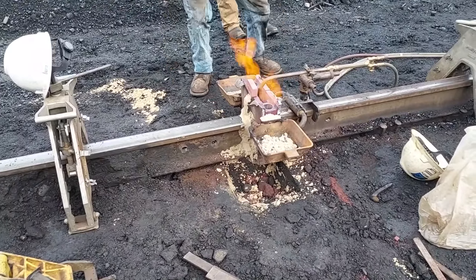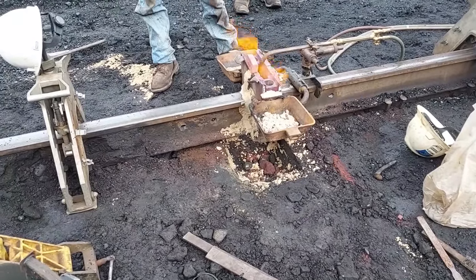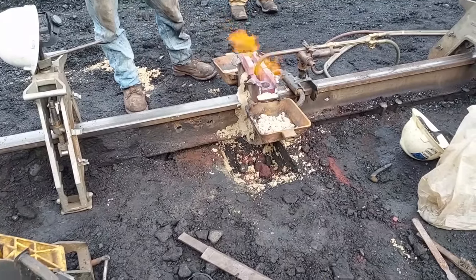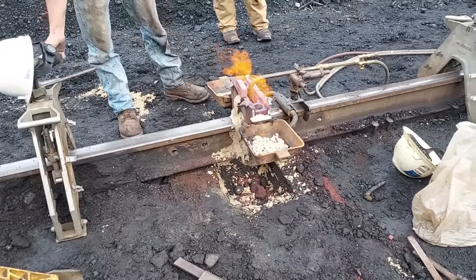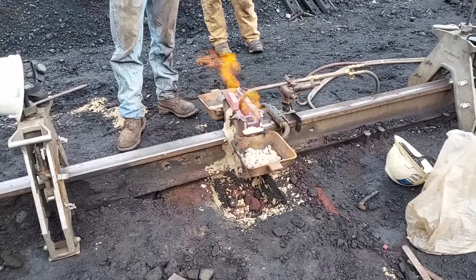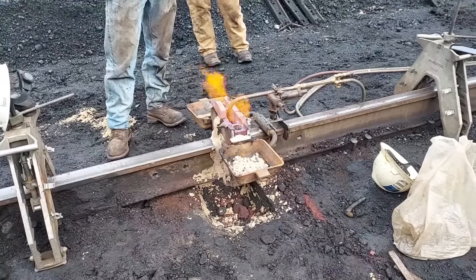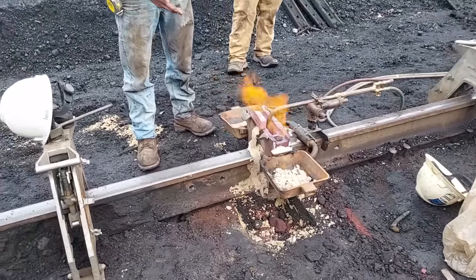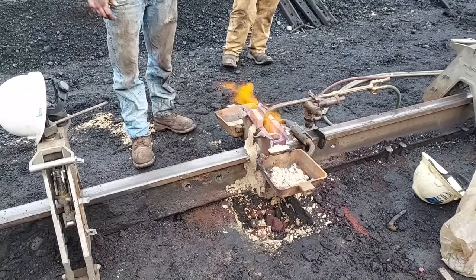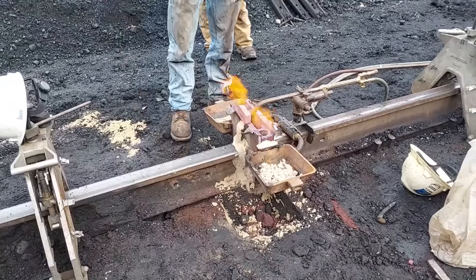How hot is it, Tyler? It's about 200 right now. 200. That's a couple of inches back from where the weld's been. What would you like it to be? There's that temperature there. I just check it because if I'm shooting one and I see that one's 500 when I shoot it and one's only 200, something's not right there, huh? I understand. I'll tell you what, you know your stuff, buddy.